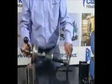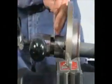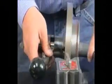To be sure that the ball handle roll pin is facing up, lay the stack down so that the ball handle is pointing away from you. To remove the ball handle, use a punch to knock out the roll pin. After the ball handle is removed, also use a punch to knock out the upper sleeve roll pin.